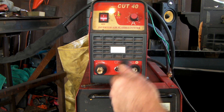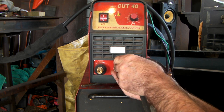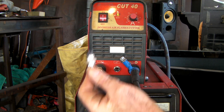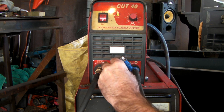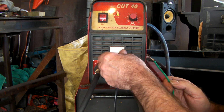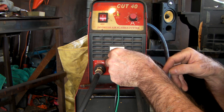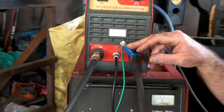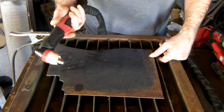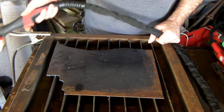Here's my plasma cutter — there's your normal earth plug for your earth clamp. I've modified this one, so this is how it works: plug it in like so, then grab the connections from the pilot arc torch. This one goes in here, the little switch goes on there, and instead of having the wire draped all the way back to your earth clamp, I just use my little modification right at the machine. Let's go and see if it works.